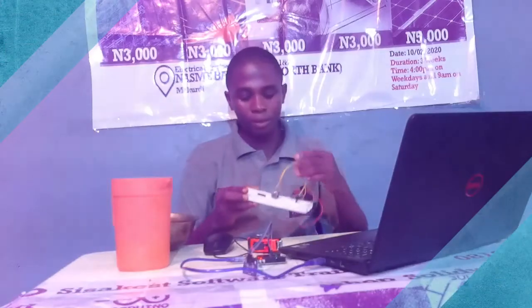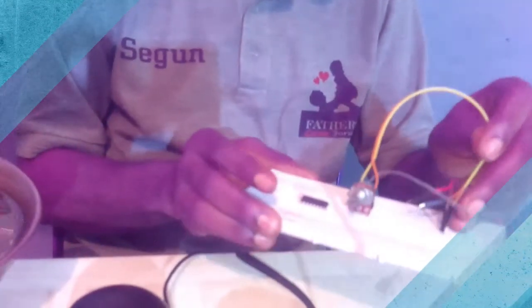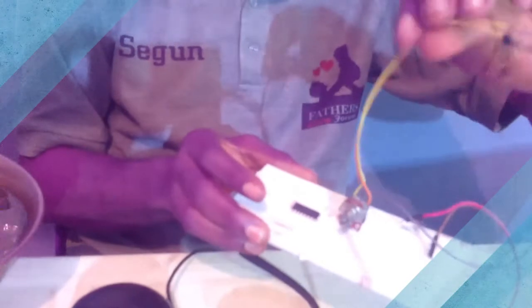A potentiometer has three legs: the two extreme ends and the leg of the slider. What we are saying is that you are changing the value of resistance as you move from one extreme position to the other. What simply happens is that you are changing the value of resistance between these legs. So the central limb, the most important limb, the slider, will be connected to analog pin A0, and the other two legs carry the VCC and the ground. So let's put that in coding now.